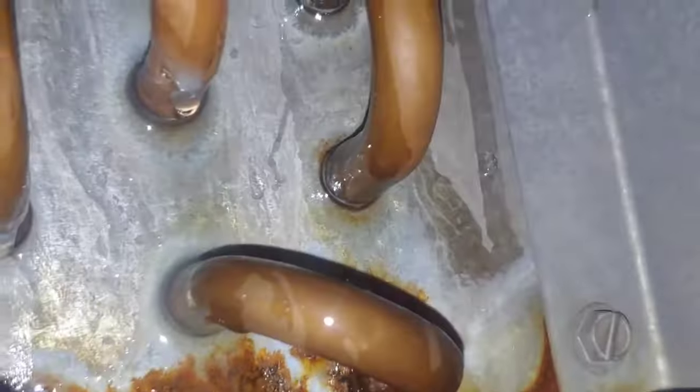There's little leaks all over this coil. And they'll worsen. Right now they're really not too bad, but I have to identify a leak on this rack to be able to add refrigerant. More than one is better because it just lost a lot, so I'll probably condemn this coil and call that cooler down there fixed.